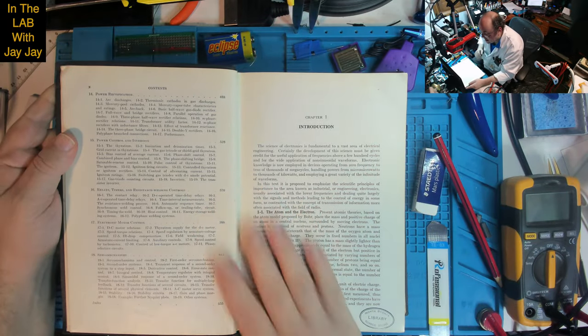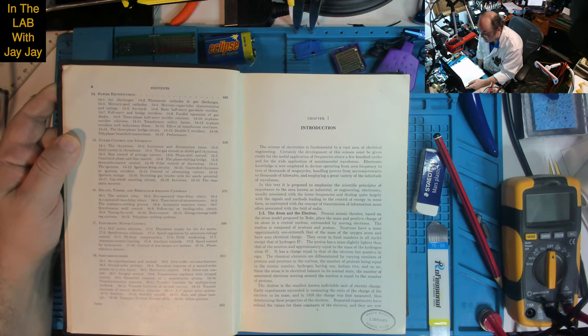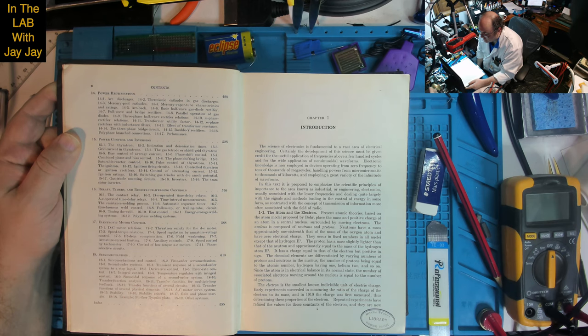Chapter 14, power rectification. Arc discharges, thermionic cathodes in gas discharges, mercury pool cathodes, mercury vapor tube characteristics and ratings, arc back, basic half-wave gas diode rectifier, full-wave and bridge rectifiers, parallel operation of gas diodes, three-phase half-wave rectifier relations,